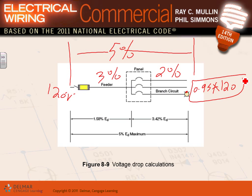So a lot of engineering firms, guys, end up oversizing. If the feeder is 100 feet or longer, you go an extra size. So if you need a 4-aught, you go 250. Just go one step higher. But the proper way to do it is to lay out your feeders. Have you noticed the building that we have? Where was the feeder? We have a main panel right here, right? And the sub panels were right next to it.